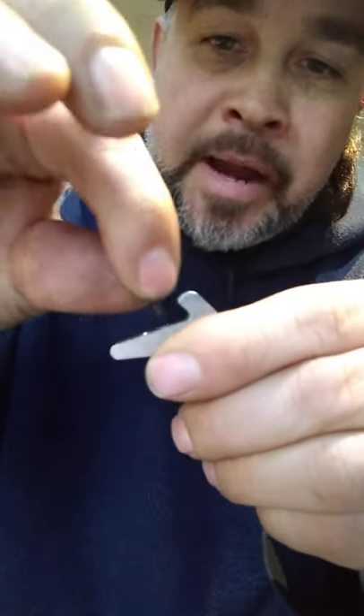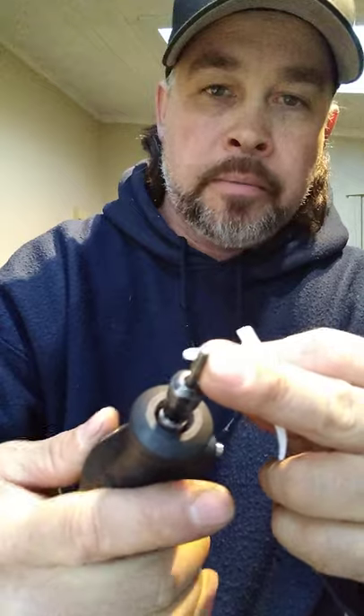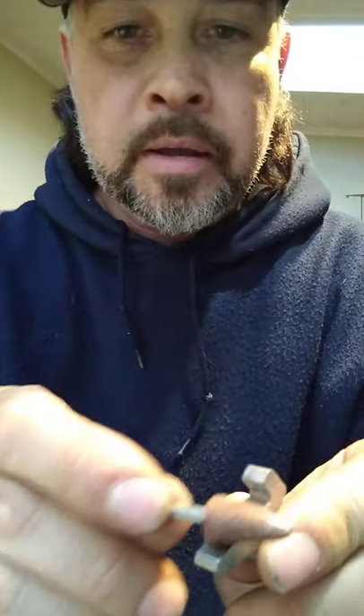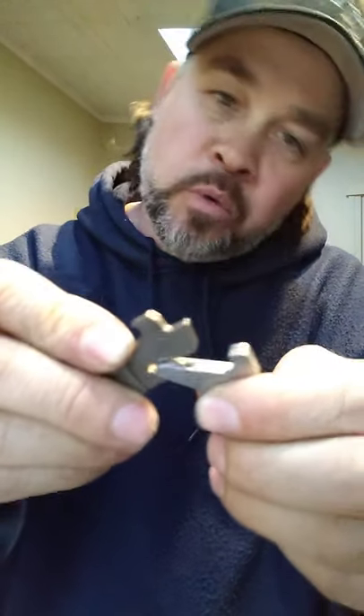It's still a hard trigger, but you could feel the spring through the trigger because of metal-to-metal contact. The spring was catching — I was getting the edges of it, it was kind of binding on the sides. So that's what I did. I used a carbide-style bit, and then I used my stone just to get the burrs out on top and just rubbed it there. I just took out all the burrs with a stone and just feel it. You don't have to worry about the actual contact of the trigger points because it's pretty smooth already. It was just that spring when it was compressing — it was catching on the sides and you could hear creeping.